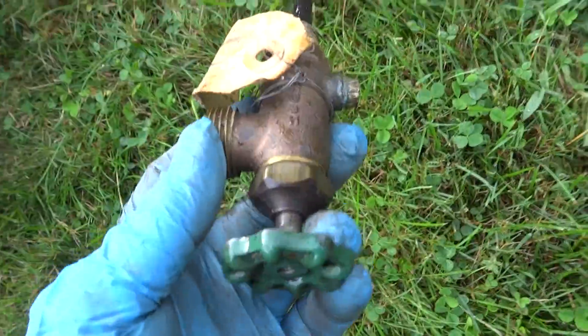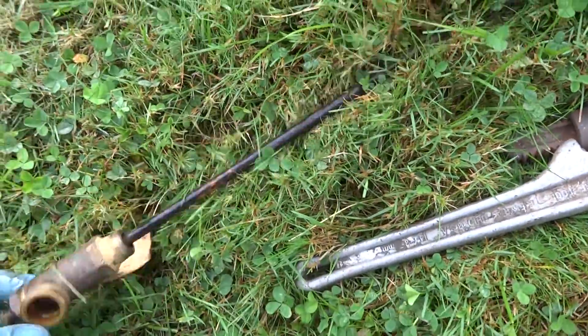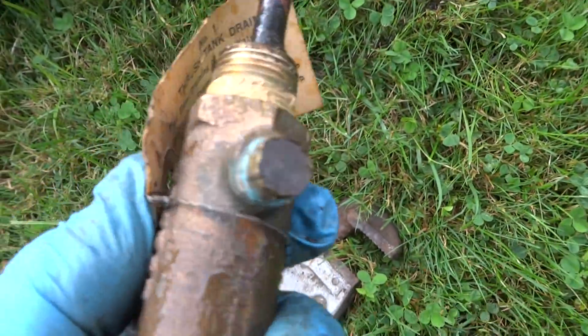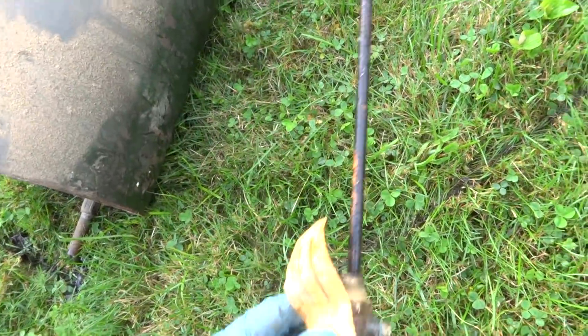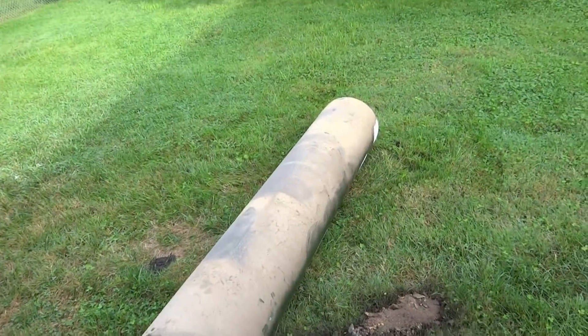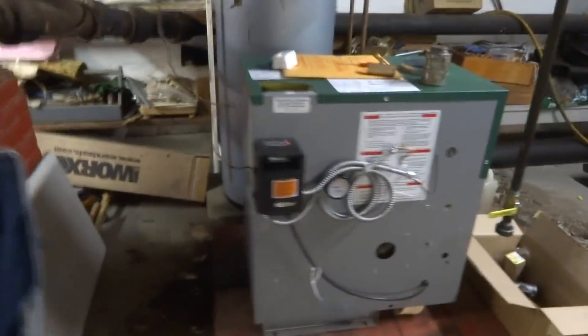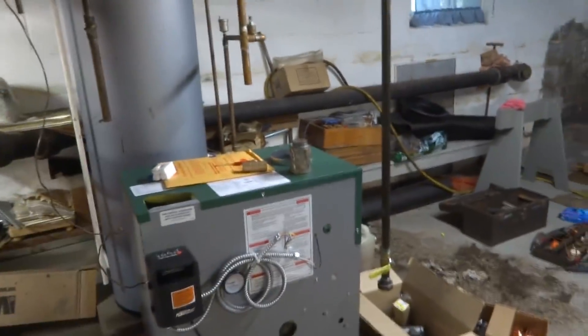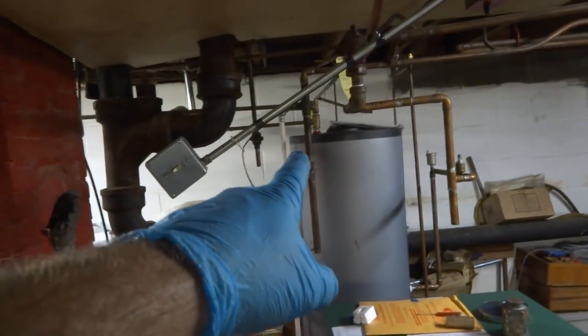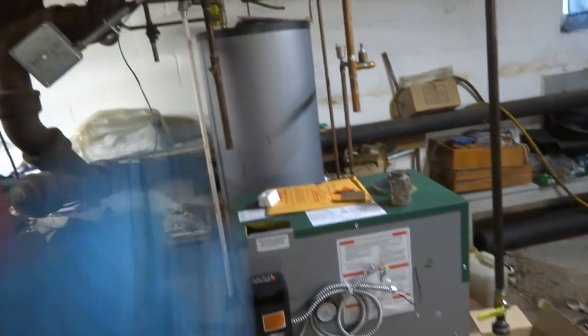I did save this — they're expensive, so I'll save them if I'm using it on a job somewhere. Open that up and it lets air up into the tank. I'm going to save that. The two-zone control will probably go in the back to feed the main boiler. I've got the return on that side — it's probably going to come around back here. I'll put the circulator over here somewhere, I'll determine that.